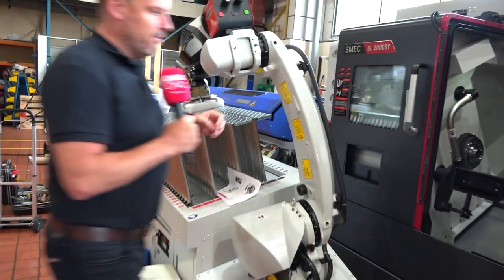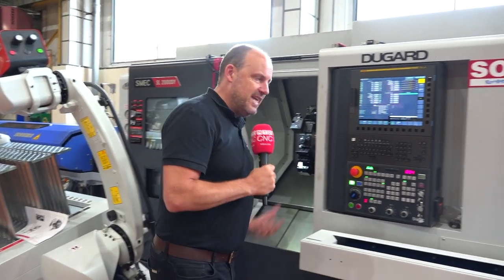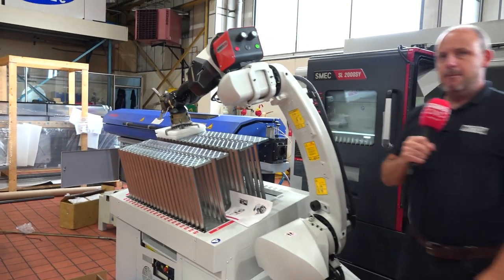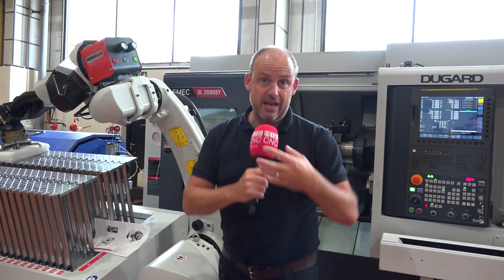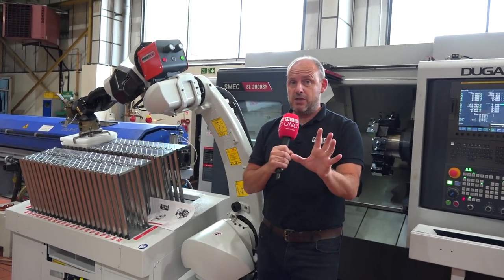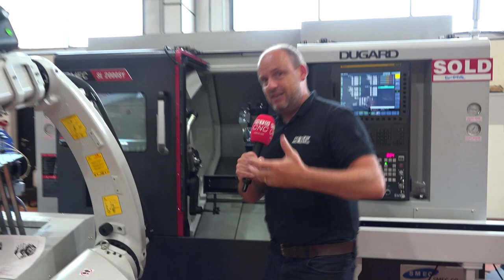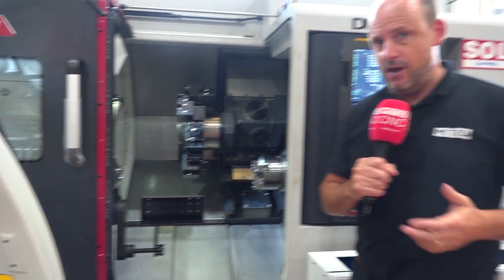What this is actually replacing at Stuart's company is a gantry loaded machine. I questioned why he would choose this over the gantry loader, and the first point was that this is a far more flexible method of loading and unloading — you don't have to have as much consistency with the parts, you can have bigger and heavier components using this RoboJob solution. And he never knows what's coming through the door as he is a subcontract machinist, so it gives him a lot more flexibility. Also, you can use this as a normal turning centre to do simple 1s, 2s, 3s, 10s, 20s off — if you don't need the automation at that particular time, you don't have to use it.